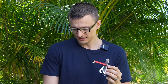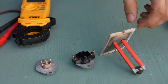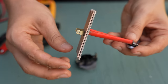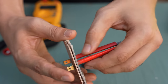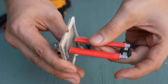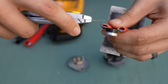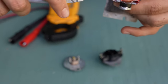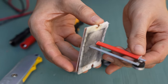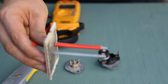Let's move on to the testing phase and test this switch to see what it looks like on a meter. I have three test subjects here — three different limit switches — and we're going to start with this one, which is a fairly common one in gas furnaces. It basically has two connections with two metal prongs that go out all the way to the switch and connect right here. Let's cut one of these sleeves off so we can see what it looks like inside — it's literally just a piece of metal. This part would be on the outside of the furnace and this part sticking in would be measuring the temperature of the air going past this little switch.